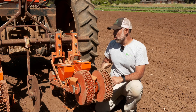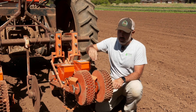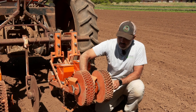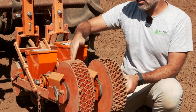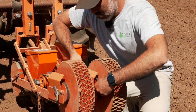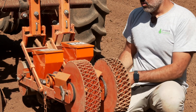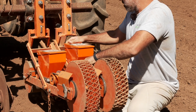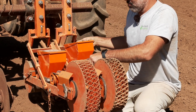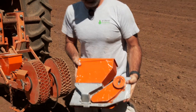So now I want to take a closer look at the hopper. We're going to hand-loosen these tamp wheels on either side - you see that this can slide back and forward, which is how we set the tension on the belt. That belt will just slide off of our drive pulley, and then the hopper itself will just slide back and pop right out.